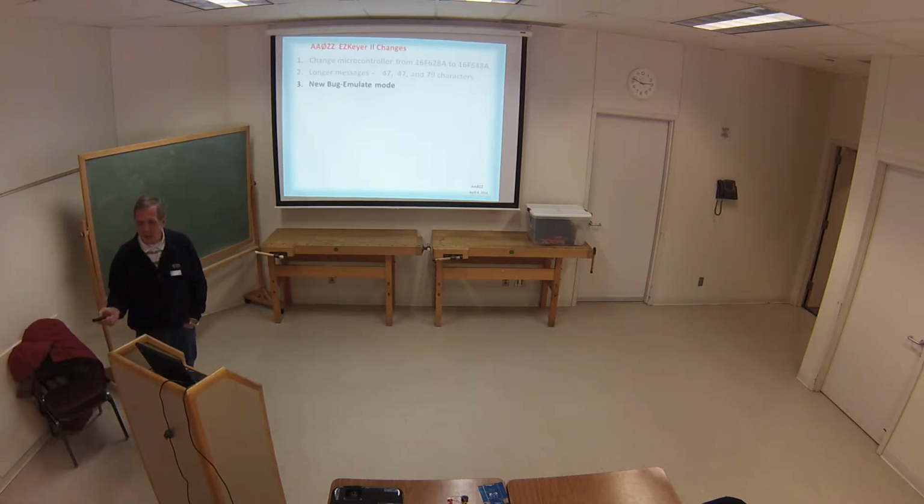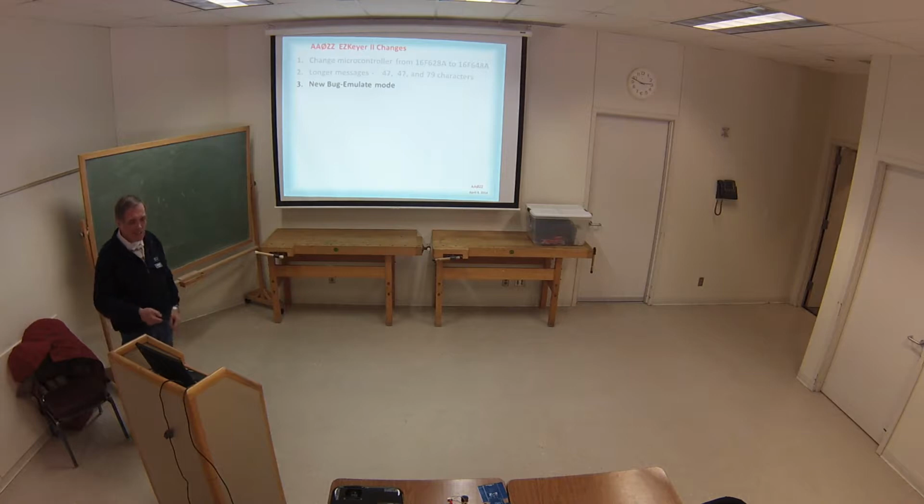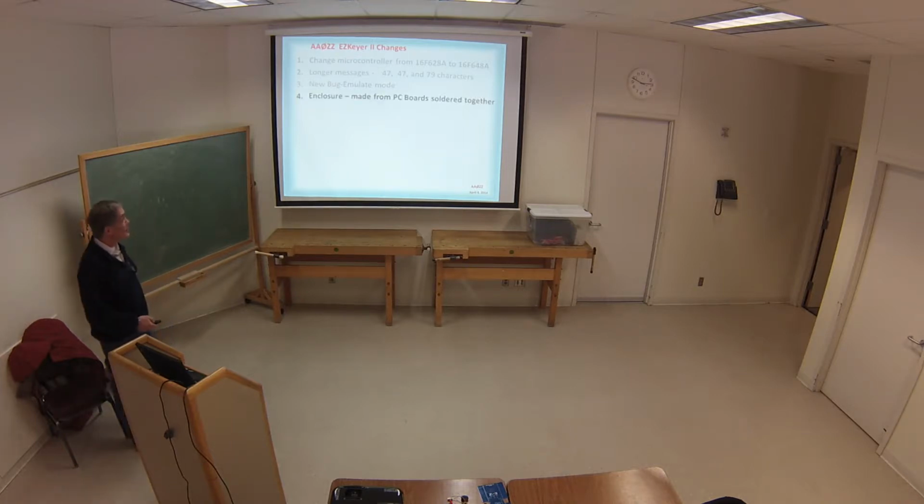One of the guys in Ozark County last year says, I won't have any keyer in my shack that won't emulate a bug as well, because I want to stay current with how to use a bug. I thought, okay, I understand. I'll give you a bug emulate one. So I was able to work it into the code and some of the algorithms. So now the DAHs are manual on one side, and the DITs are automatic on the other side, and it works fine. So bug emulate is one of the menu selections you can do now.